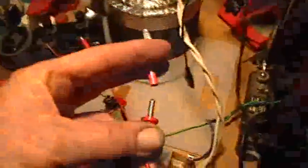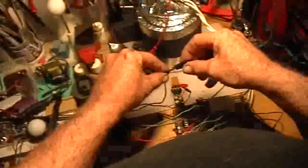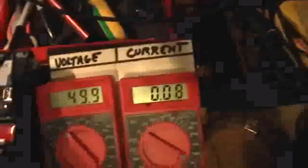Let me just go back. We'll unhook the power supply to the inverter and put that back on the Elenco regulated supply. We'll take this off of the battery negative. Once again we're running off of the Elenco — and there are the common drain oscillations. You can see that the gate drive signal goes back up to zero now, and we're back to 60 to 70 milliamps on the inline meter and 42 milliamps on the Hickok.